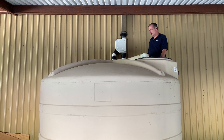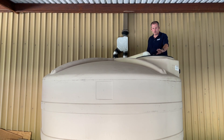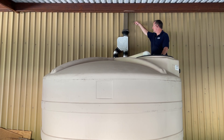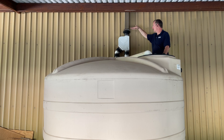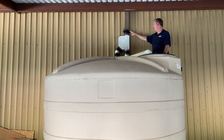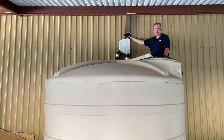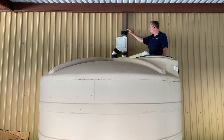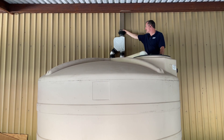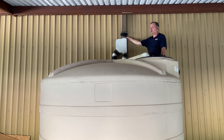In this particular application, the customer has a 3,000 gallon poly tank with a filter basket on top. The Mondulon filter is connected to the downspout here. You had to cut the metal downspout with a metal blade and then attach a rubber boot — a six inch to four inch reducer boot, or Fernco boot as it's sometimes called — with stainless steel clamps to get a nice tight fit around a square downspout like this and a round down pipe like this one.